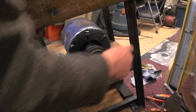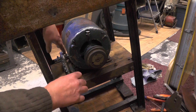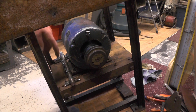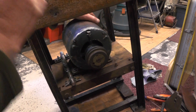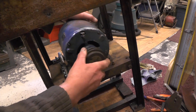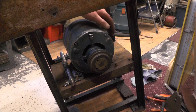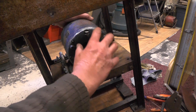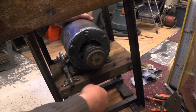This is the bottom underneath the shelf. I've put two U-clamps on with a shaft through, and that shaft's clamped to the shelf. I fitted a piece of angle to the foot of the motor and bolted it on, and I've welded a tube onto that angle so the motor now pivots and is also able to slide. When I put my other pulleys on I can slide it into position. I'll put an angle that comes to the front to make it easy to use — just get the handle, slide it over, then locate the angle into the next notch. I may have to cut an access hole in the side panel to drop the belt onto the next pulley.